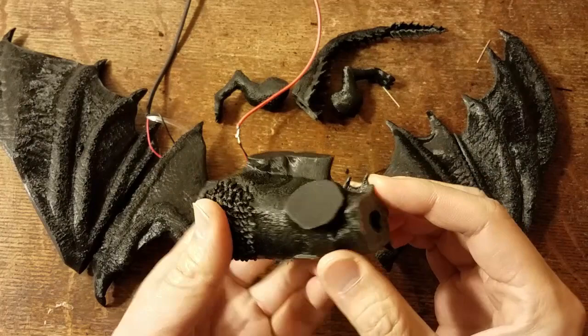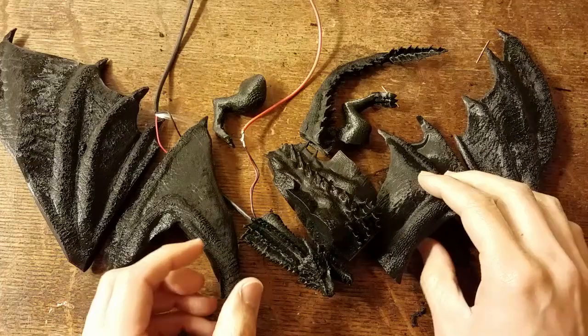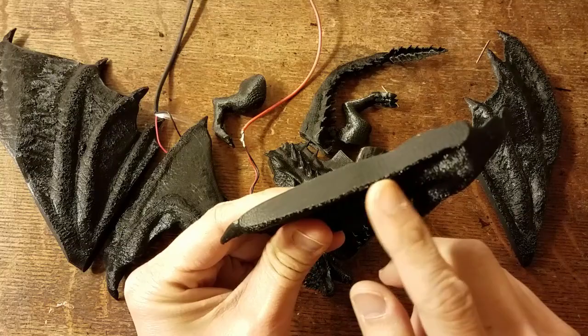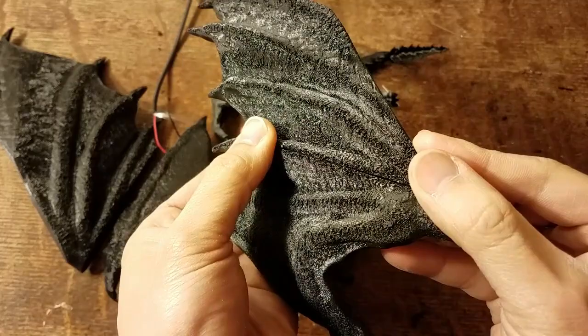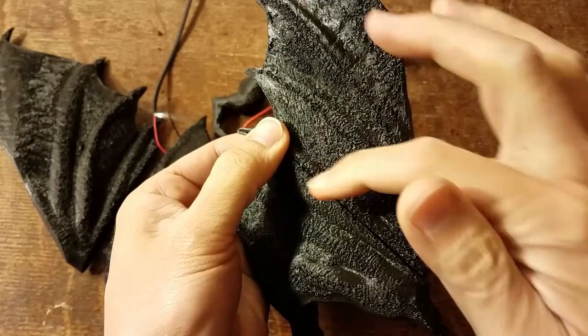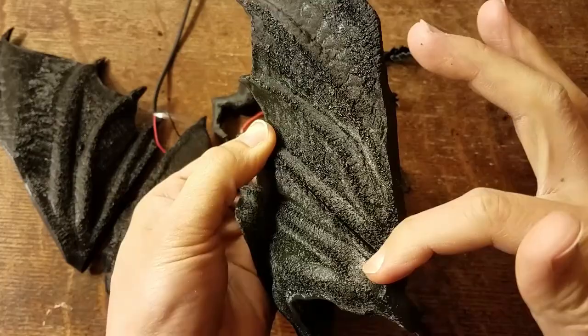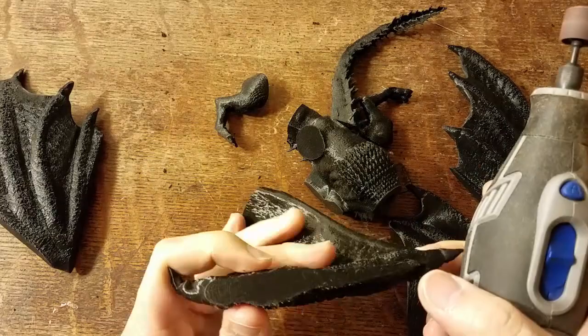On the remaining parts there are a lot of rough edges from the 3D printing. To make the gluing process easier we need to smooth out the rough edges on the sides so that when we put the two pieces together it will be nice and smooth. You can use sandpaper or a Dremel with an abrasive bit to quickly clean up the edges. After that, we also need to gently rough up the smooth surfaces so that the glue has more area to grab onto, because if it's too smooth it's hard for the glue to stick.